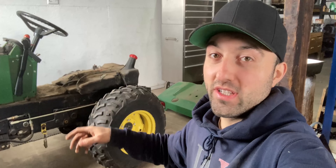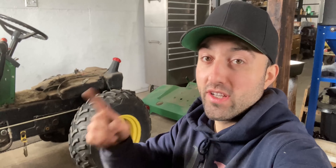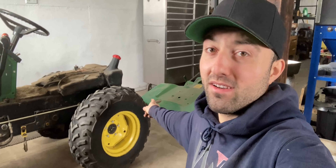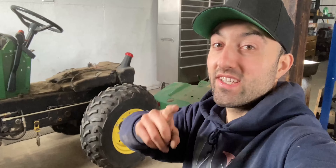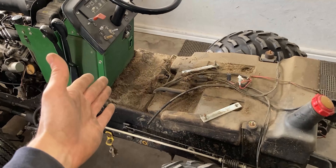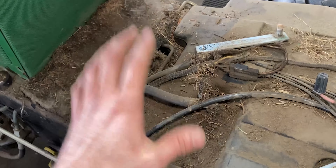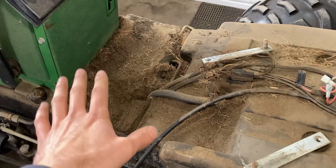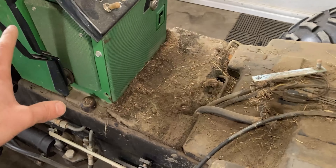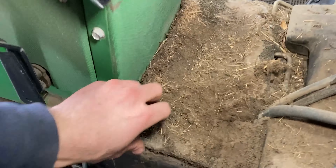I finally got the rear fender pan off the John Deere 332 — it was actually much heavier than I initially expected. The John Deere 317 or 300 fender pan was not that heavy, so this must be thicker sheet metal. Underneath the fender pan you'll see how dirty it actually is. If you never remove your rear fender pan on a John Deere garden tractor, this is how it'll look: a lot of debris on top of the mat, a lot of debris on your fuel tank, especially if you're mowing lawns or working in dirt. You want to take this off so your engine can cool properly, because air gets drawn through the instrument panel from the side or even the front.